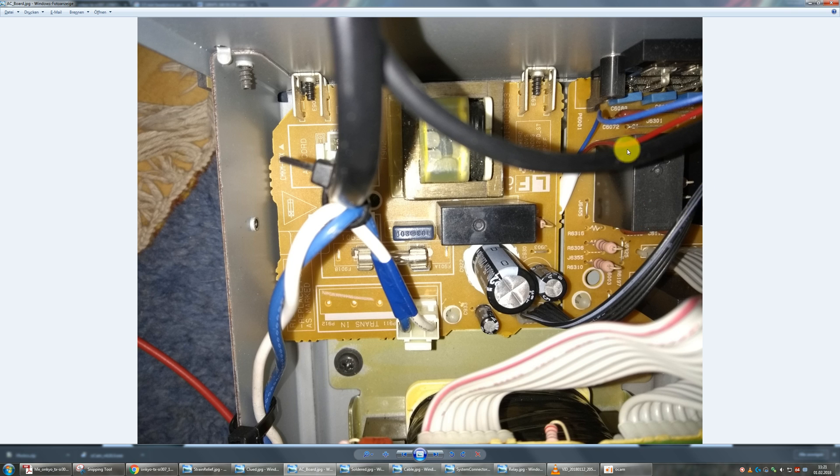You will notice that there are other relays in the circuit — for example, the relays for the speaker outputs. So now you can basically decide when you want your subwoofer to turn on. For example, do you want it to turn on as soon as the amplifier itself turns on, or maybe only when the center speaker is turned on? So for example, if you're in stereo mode, the subwoofer will still be off. You just have to find a 12-volt rail that is always present when you want the subwoofer to be on.